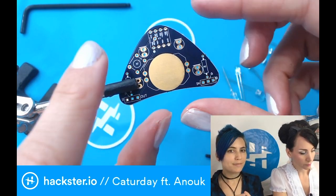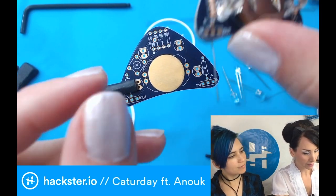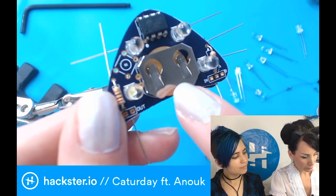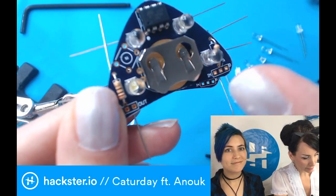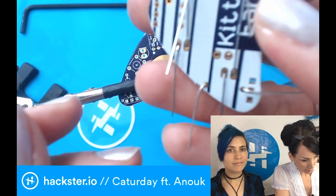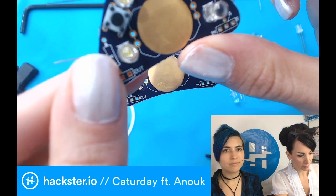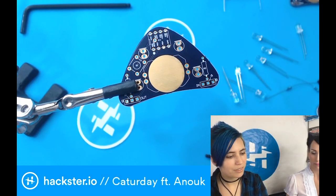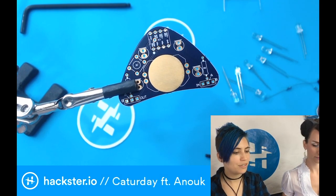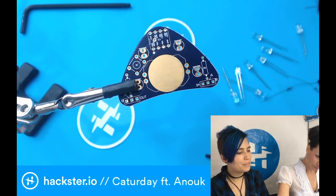Yeah, and in the through-hole one, what we're going to place is basically the battery holder on the one, and the LEDs, the AT-Tiny, and the resistors on this side. So there's nothing on this side. And then you have the LEDs and the button on the other one. Cool. And then a little string in between. And you just don't put the battery in the other one, we have one battery running the 2 boards. Rad! And then you connect them with 3 little wires.